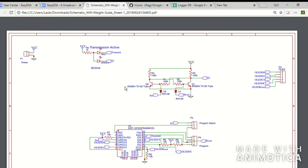The next and most interesting part — the main circuit for battery saving — is this SR latch, which is connected to the chip power-down or reset pin of the ESP8266. What it does is monitor the incoming TX line from the scale itself and set or reset the reset pin accordingly. If the chip is in the reset or power-down state it consumes very little power — around 700 microamperes when idle. But as soon as you step on the scale and the scale starts transmitting data, the SR latch triggers and kicks the ESP8266 into action.